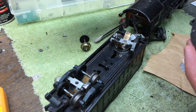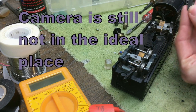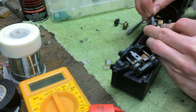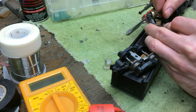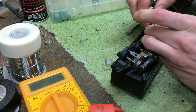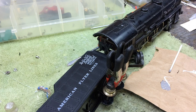Now, it would be a mistake to put this together and forget the wheels. So I'm going to move the camera over it a little bit. I have put the JB Weld on and it's clamped. It has to cure for four to six hours to set, and overnight before putting it to use. So this is going to be done tomorrow.